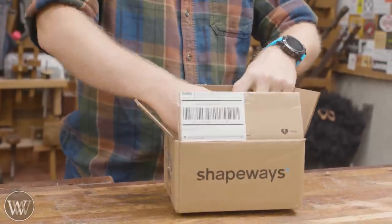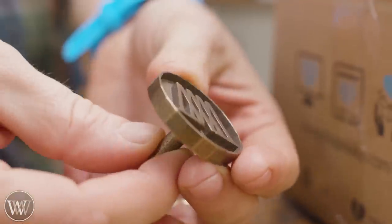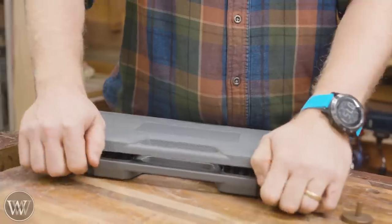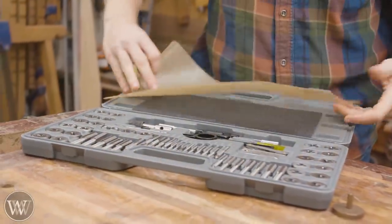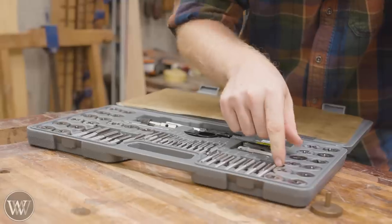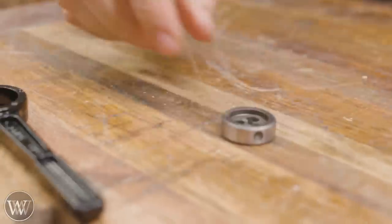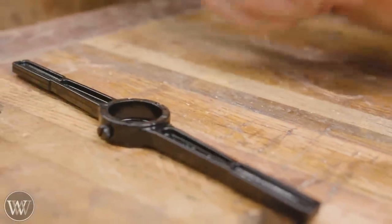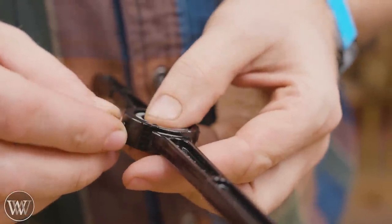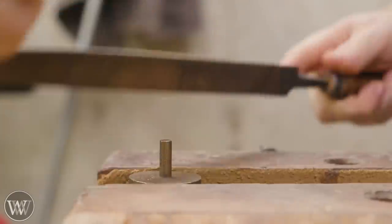It was actually only a couple weeks, so they turned them around really quickly. You can see what it ends up like — it's just about a quarter inch thick on the top, eighth inch for the base, eighth inch for the text, and then a quarter-inch shank coming off the back. On that shank, we want to cut threads — we want to die it with a quarter-20. Shapeways will do that for you, but it is far more expensive than the 3D printing, so it's just easier to use a die that you have.